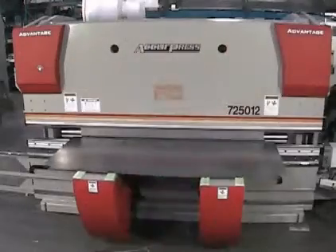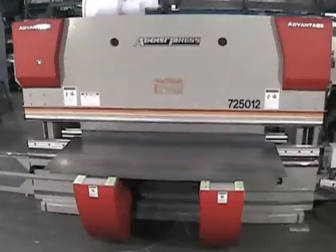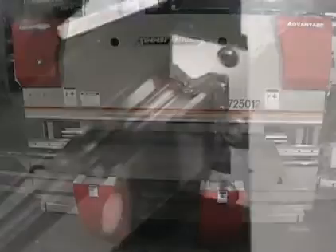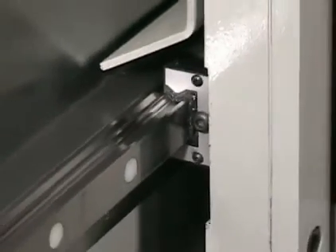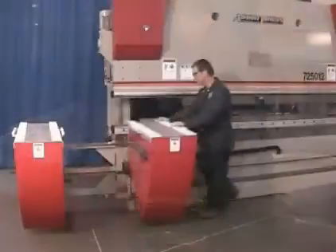When built to order, a dual set of sheet followers are mounted to the Acupress and are positioned left to right via a linear bearing rail machined into the press brake and extended beyond the bed length to permit parking the sheet followers past the left end.